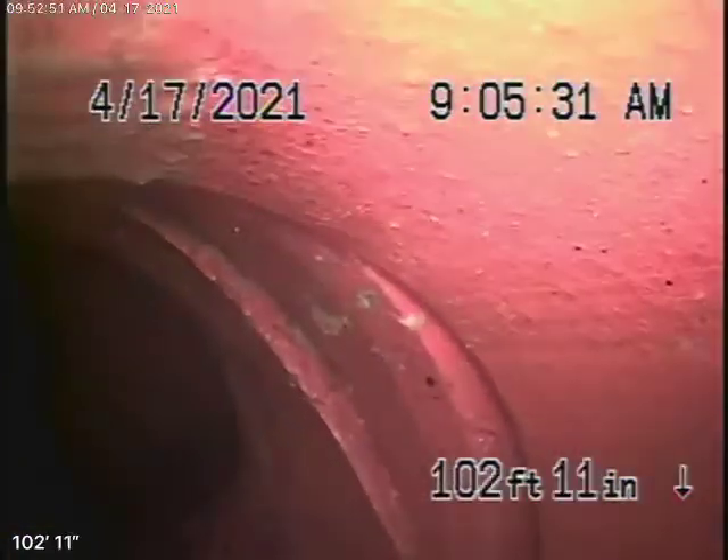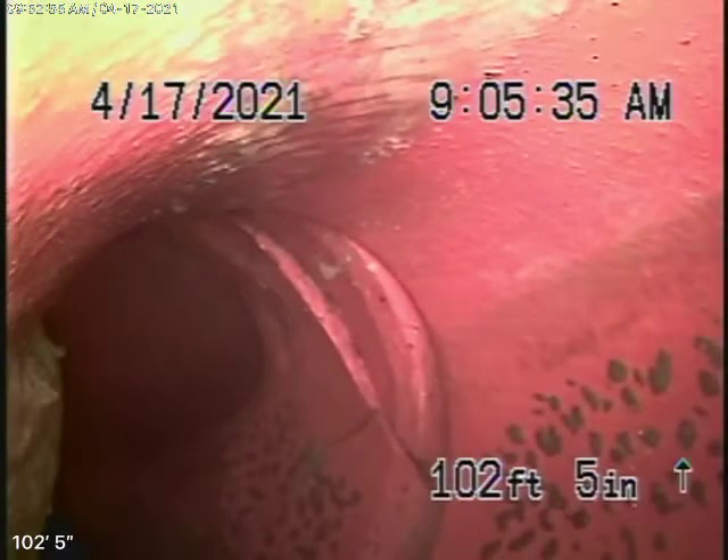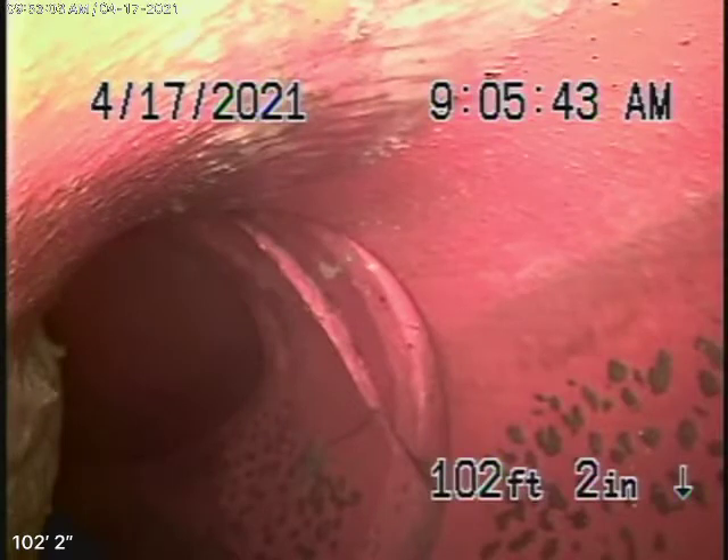There is a city sewer floating by. Let's bring it back very slow. Now there's a clay pipe here, and right at the city connection you can see it's slightly cracked. It's common to see slight cracks in the clay pipe and minor roots, but you can see it's slightly cracked right at the eighth bend where it turns into the city sewer.